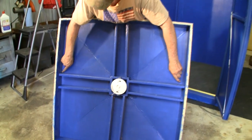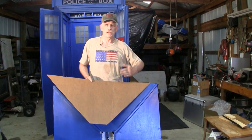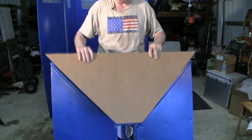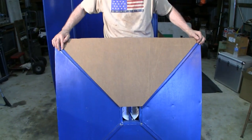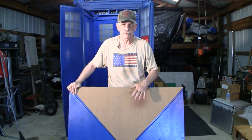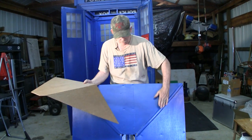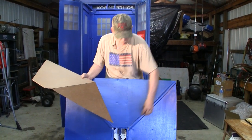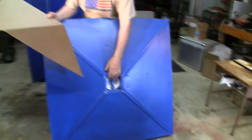Once all the pieces are cut, disassemble the square, screw the angled pieces in from the outside, put it back together, and you get this spider — eight pieces of wood. Attach the spider to the top edge of your frame. To fit the top panels, take corrugated cardboard, lay it out, line it up, mark the corners, and cut out four cardboard pieces. Once the cardboard fits correctly, use it as a template to cut Luan and glue it right onto the spider. Add simple molding to cover the corners.